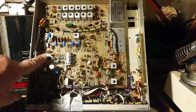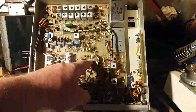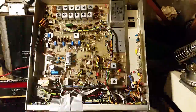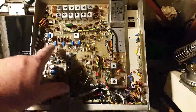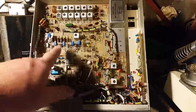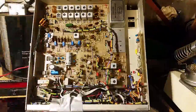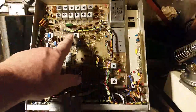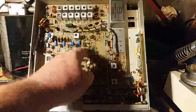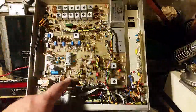It's mainly a transistor and diode-switched arrangement in the design, with a few ICs — there's an audio amplifier IC, an IF amplifier IC, and that's about it. All the rest is discrete transistor. You can see these blue pots here — these are the ones I used to generate a voltage so the micro and the DDS knows which band I'm on. Originally there were six crystals, but I inject the DDS in here — you can see the injection point. And that's the 1650.